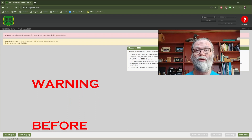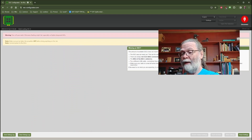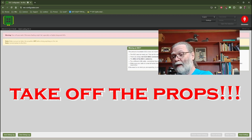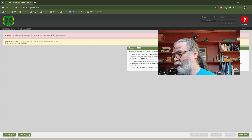When you do any work with the flight controller or the ESCs on your desk, make sure that you do not have any props on your quad. Messing around with the ESCs is a really good opportunity for the propellers to spin up randomly, and you don't want that. So take your propellers off before you proceed. Once you've done that, plug in your LiPo.